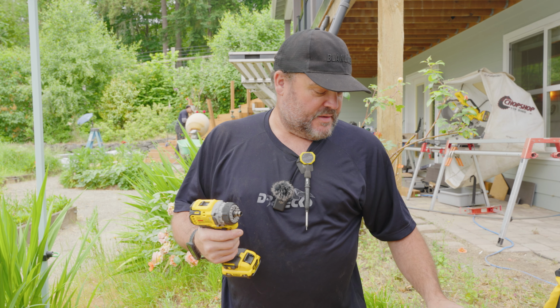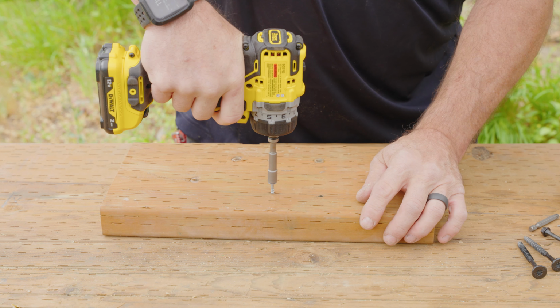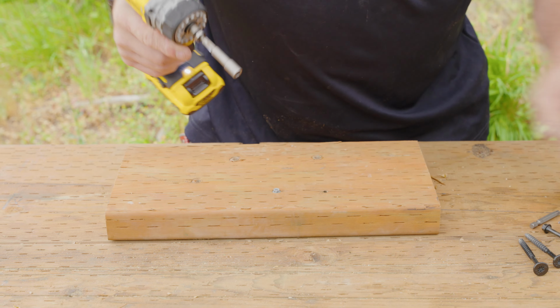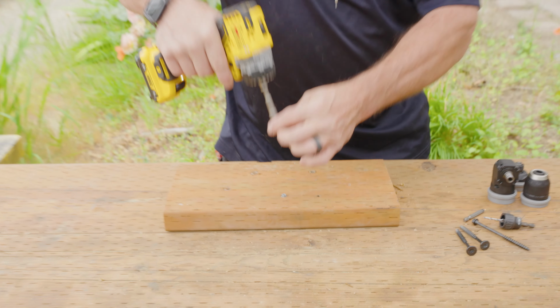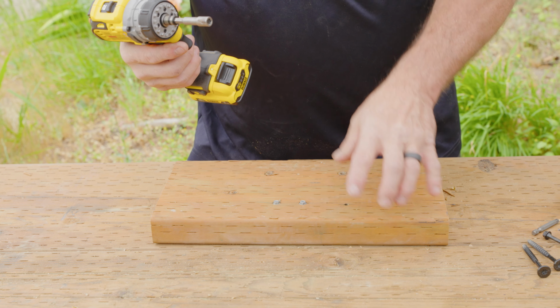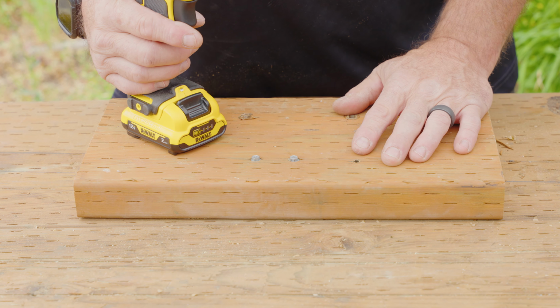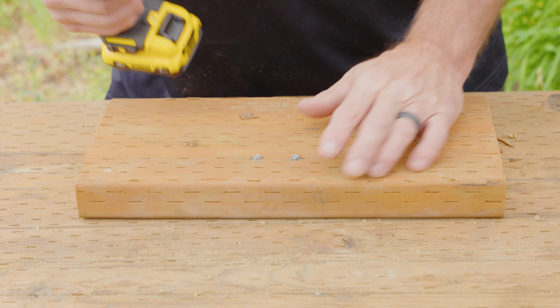Let's just run something with a standard 1/4 inch drive. Here's some SD screws on slow, and let's put it on fast. So the thing about this drill, what I'm noticing, with an impact driver, rat-a-tat-tat, your fastener's a little deeper into the material. This actually stops fairly flush when you're installing. So if you got somebody that's overdriving fasteners, you might want to give them one of these so they don't overdrive your fasteners.